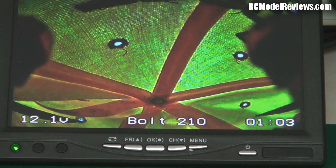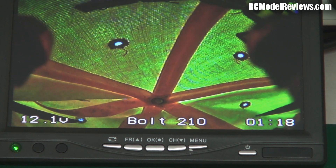If you don't want the timer, you can turn it off. If you don't want the voltage, you can turn it off — though why would you not want the voltage? The accuracy is not too bad, about 0.1 of a volt out. I measured it with my Fluke multimeter — the OSD says 12.1, but the actual voltage is 12.28, so it's reading 0.18 volts low. That's well acceptable, I'm not too worried about that.